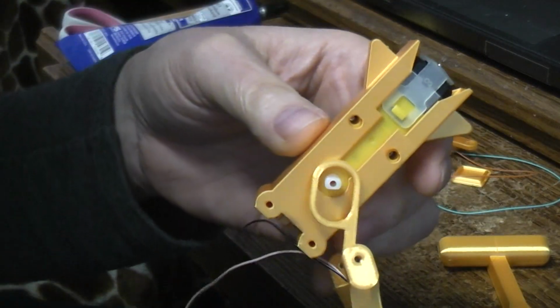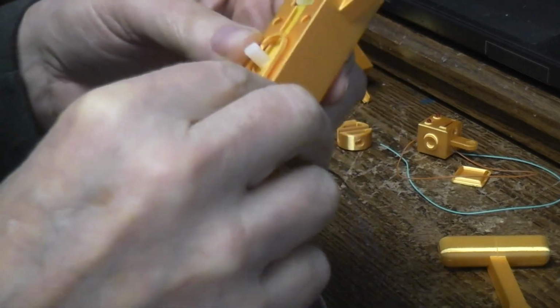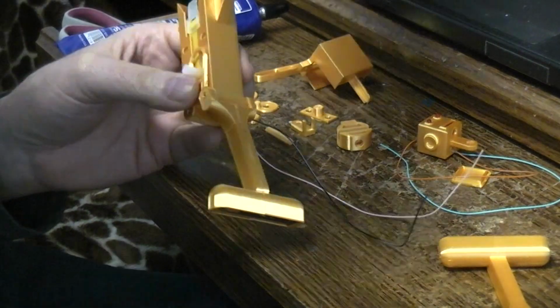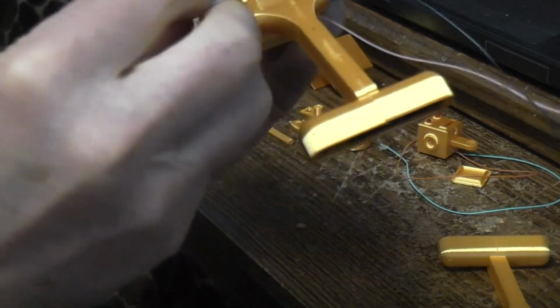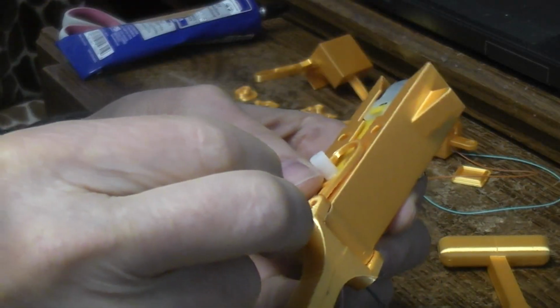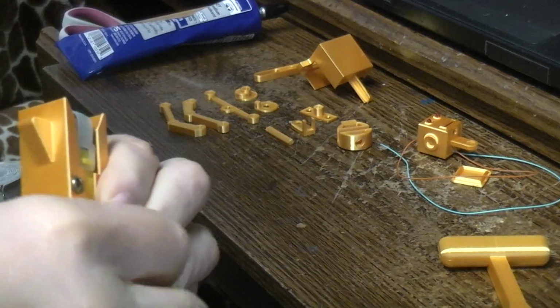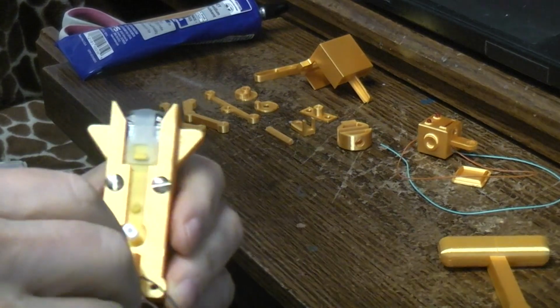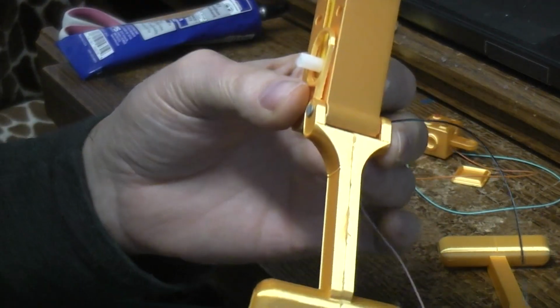And fit it over that shaft in the front, and it should, if you've cleaned up all your parts, all line up there. I'm going to take, in my case, some nails. I've already cut them down so that when they go in, hopefully they don't stick more than halfway through, because I'm just going to drive them in both sides. In this case they fit a little bit loose. If you're doing the final assembly and you're sure everything is going to be okay, you could put a little drop of glue down in the hole. I'm sure I'm going to regret not gluing them right now.